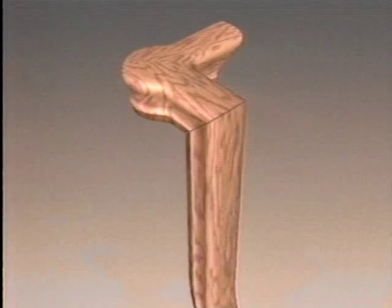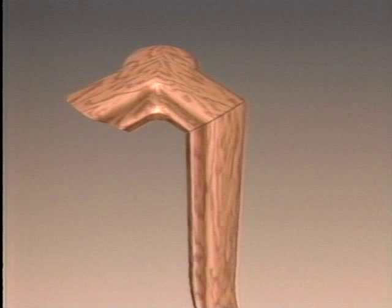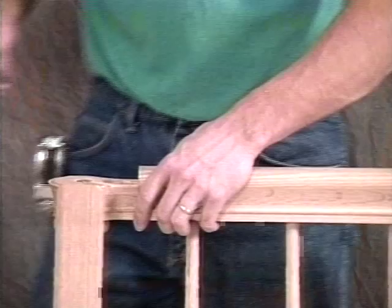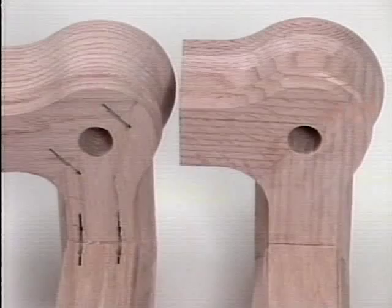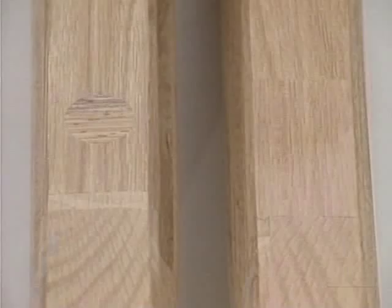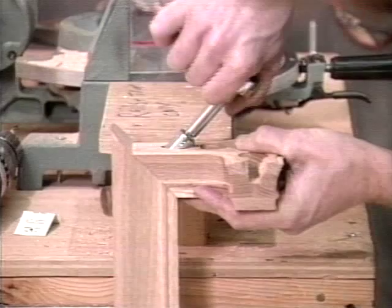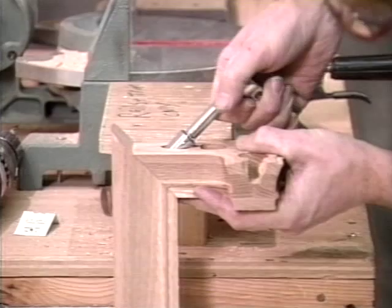This product will give you versatility by allowing you to construct a left or right-hand fitting from the same part. Parts can be used to make up a variety of fitting combinations. The seven new Connect-A-Kit fitting components will replace all of the 26 former gooseneck fittings. The biggest advantage will be in the ease of assembly. Most joint connections are made on top of the rail system for easier access. All joints are concealed, which eliminates unsightly nails and plugs. The assembly hardware is included with each component and is easy to use. The Connect-A-Kit hardware gives greater strength and allows trim carpenters to build a sturdier system.